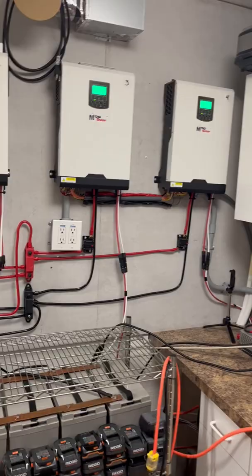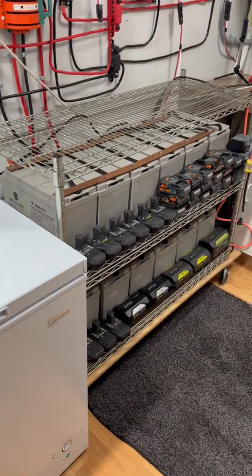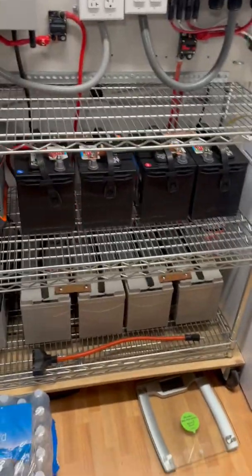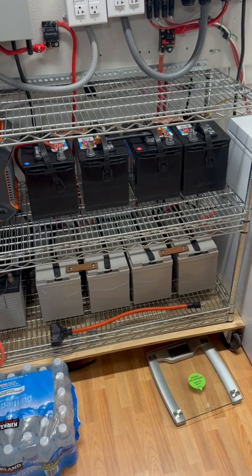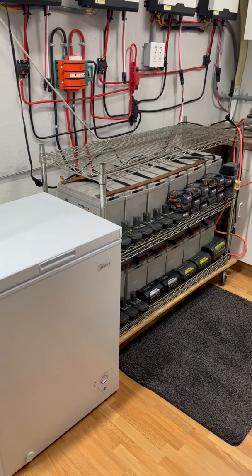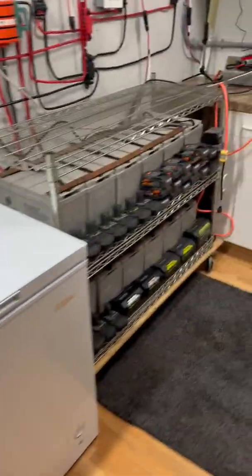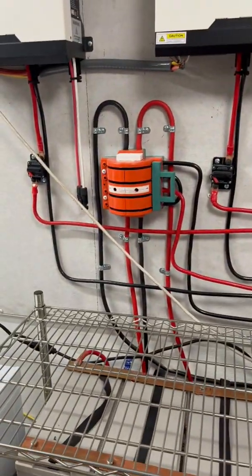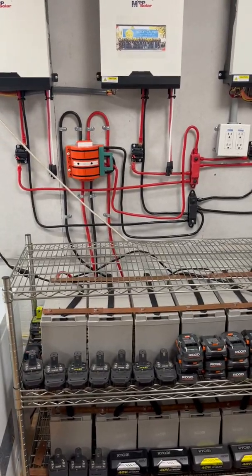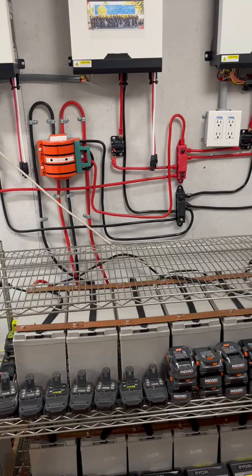The reason I like the system with the four smaller ones is that at night I can utilize my fully charged battery bank for 1200 amp hours instead of 600. To get 1200 amp hours on one of the 48 volt systems I'd need 48 batteries versus 12, and when these AGMs are close to $200 each that's a lot of money. It's much cheaper to buy a $40 switch and some two-gauge wiring — I got the switch, wire, bus bars, and everything for under $200, the cost of just one battery.